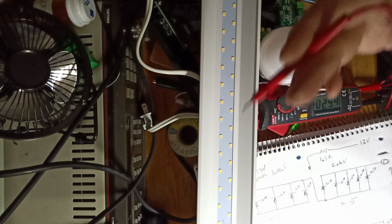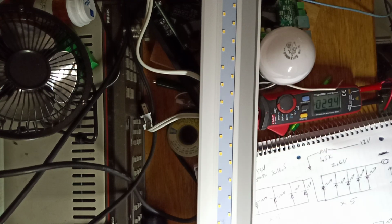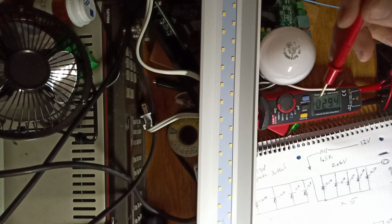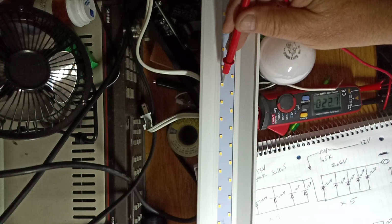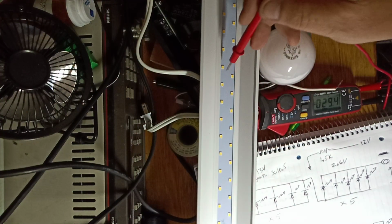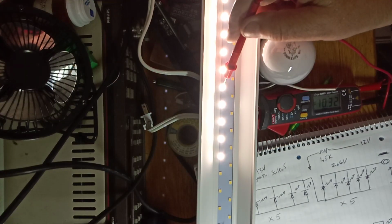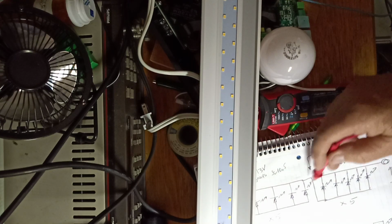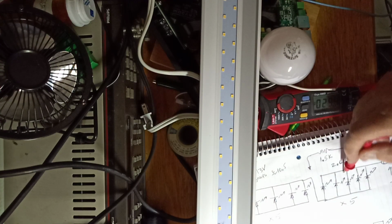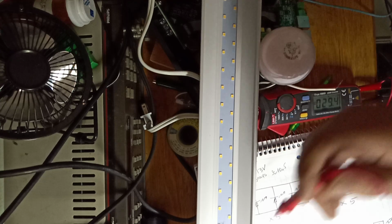This is really a neat idea. Take a probe. Now this isn't really a sharp one. There are some probes you can get that are darn right lethal, but you can generally hit the side of an LED. And with a 1.5K resistor there, you're not going to do a lot of damage in current or anything. And you can investigate. Sometimes these LEDs are put in series and then in groups. Sometimes they're in parallel. But yeah, it's just kind of interesting.